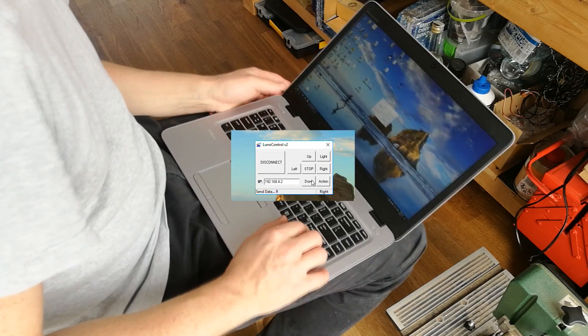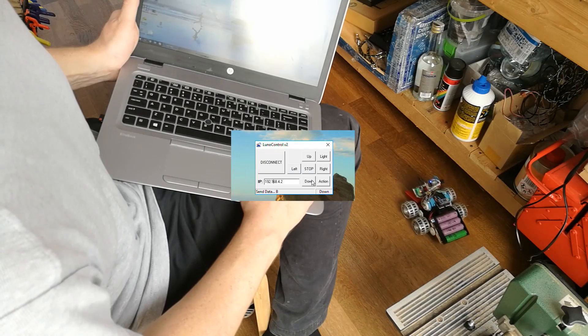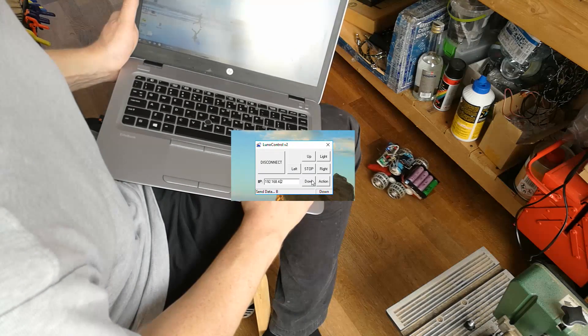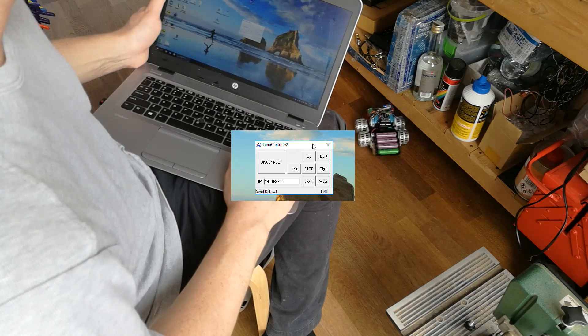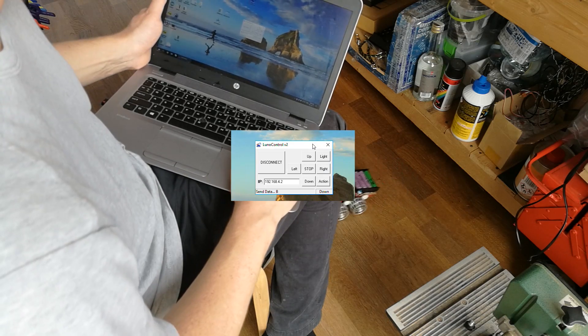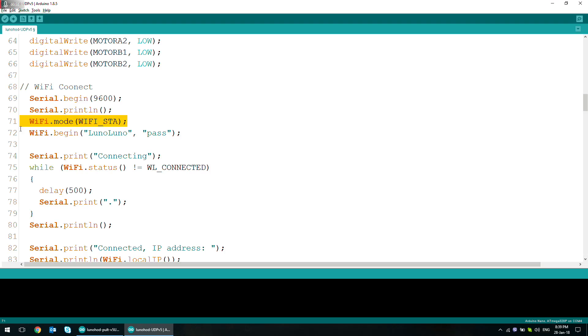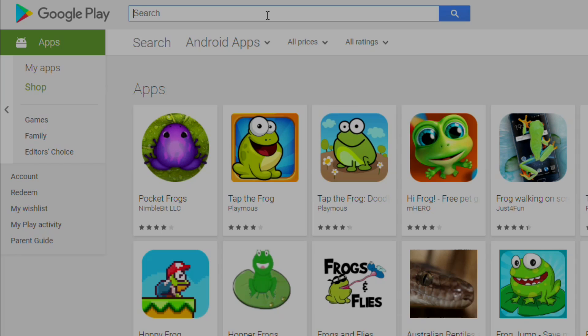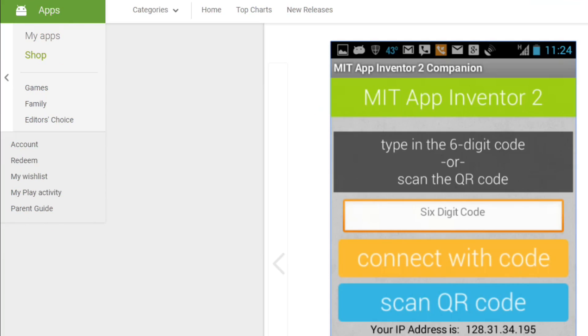This robot car can also be controlled from a PC. In that case you would keep the code of the car but use your home Wi-Fi credentials, then connect to the car using a simple Windows application. Clicking buttons or pressing arrows on the keyboard will send commands to the car. Controlling the robot from a smartphone using UDP has already been addressed by many people, so it was not the objective of this project. But if you want to do that, you could keep the robot car code as is, only changing the access point details to your home Wi-Fi network, then install MIT App Inventor and send UDP commands to the robot car using that app.